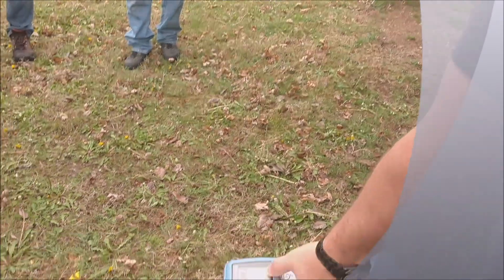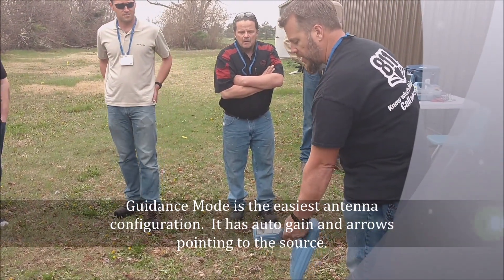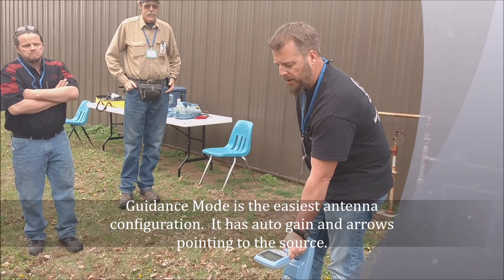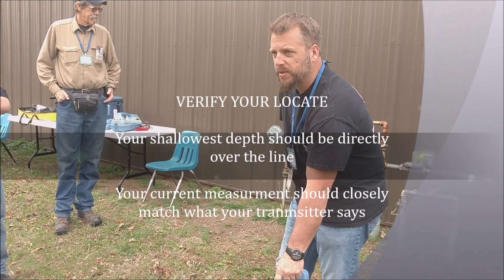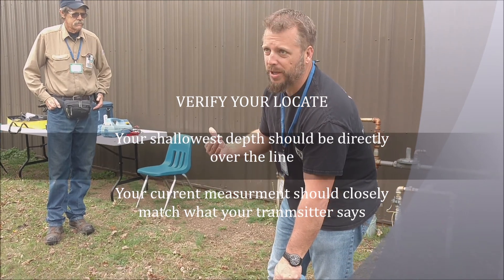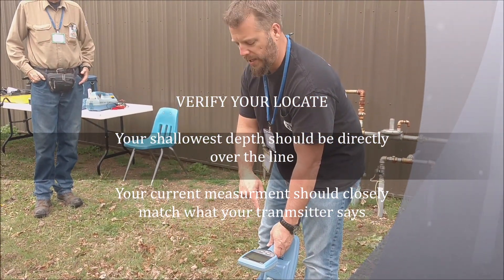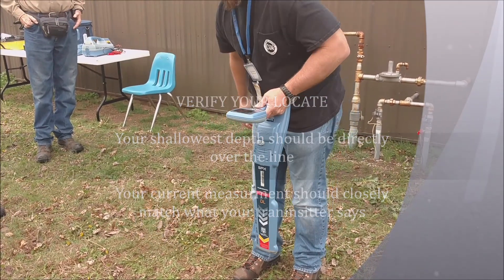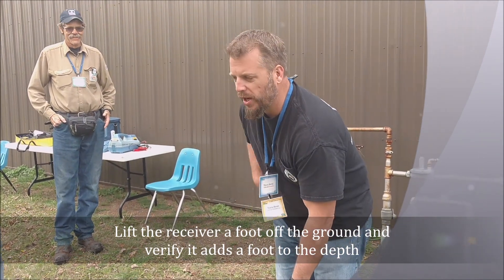This insignia right now is telling me I'm on guidance mode. Guidance mode is very simple because you don't have to do anything other than follow the arrows. As I go left and right, my numbers will go up and down — I'm looking for my highest number on the center of the screen, highest response. My arrows will tell me it's right there when I get over it. My depth reading shows up automatically — it's saying 1 foot deep, and my milliamps say 56 out of the 63 we're pushing out, so I'm pretty well assured I'm on the line. I can check this depth reading by lifting it up off the ground — if I get 1 foot right now and lift it exactly a foot off the ground, it should go to 2 feet. That's a good way to verify that your depth reading is right.